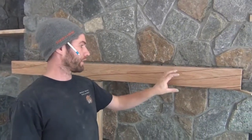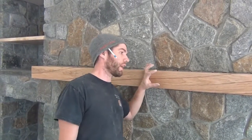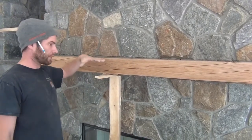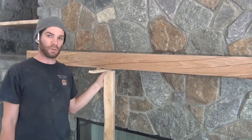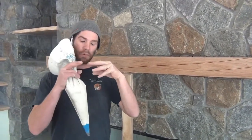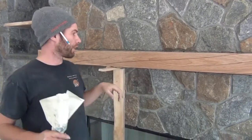We've applied the PL400 adhesive to the studs that came out and to the wall, and we've pushed it on there. Then we got it as level as we could — this piece had a little twist in it so we took the average and leveled it across. We're supporting this weight for now to get that glue exactly where we want it around those rods. Once the glue is hardened around the rods, the rods are going to hold it fast.